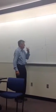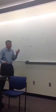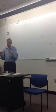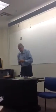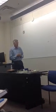In the last class, someone asked me, you've got lowercase values here, what's the difference between that? Typically, uppercase values mean it's going to be a DC or a constant voltage or current. If you get the lowercase, it's going to mean it's a time varying or an AC signal. I'm not very consistent on going to that convention, but that's really what the convention should be. So if you're ever confused and don't know what I'm doing on that, ask for clarification.